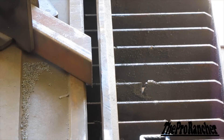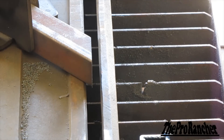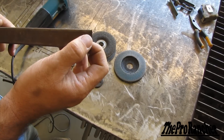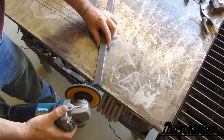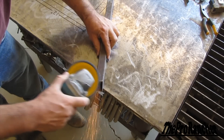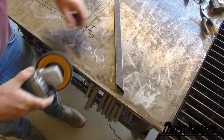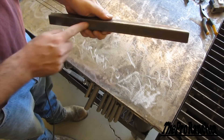There are two things to keep in mind here: this end and these edges are very hot and sharp, so be very careful. Before we make our measurement for the second cut, we need to remove the sharp burr on the end because that will affect our dimensions. Now we have a nice clean edge we can measure off of to get our 12-inch dimension.